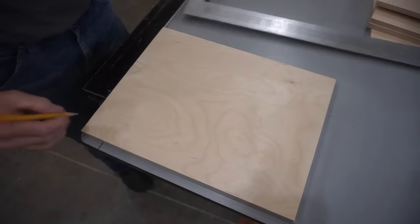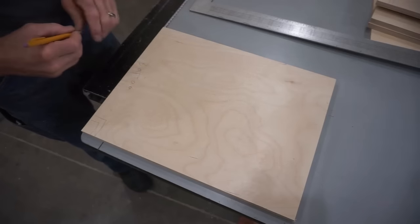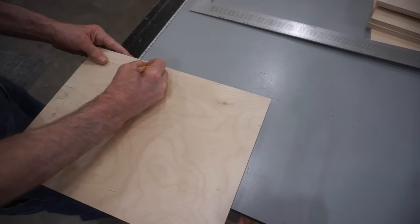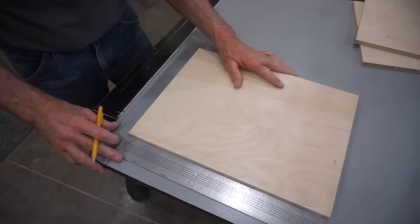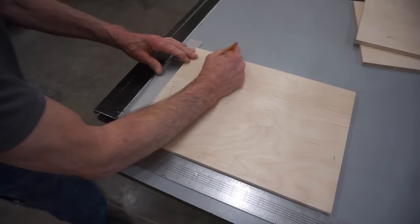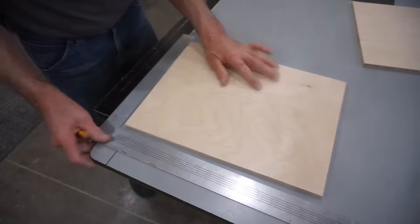Then to keep pieces organized and oriented, I put two square marks in one corner of the piece as a reminder that I've double checked it, write the word bottom on the bottom end for orientation, and then mark the opposite edge of the piece to make it clear which edge needs to be trimmed during the cut to final width. As I take these steps, I'm also orienting grain on the end of the piece by establishing which end of the piece is the bottom and squaring that end accordingly. And statistically speaking, for this project, I'm adjusting for squareness with the jointer on about half the pieces.